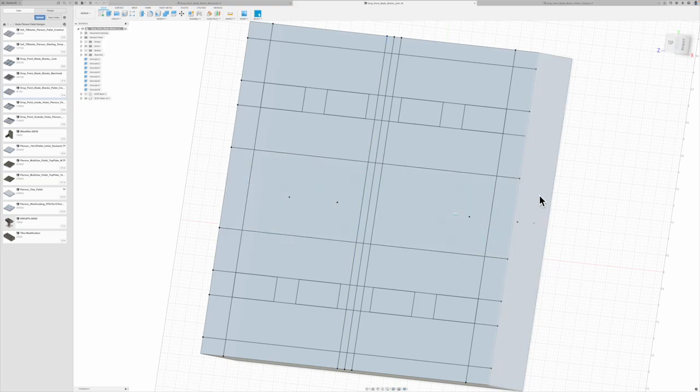First thing I learned is I need to stay away from this middle section right here and stay away from the lock rings that hold the pallet onto the Pierson Pro Pallet system. So my original plan was to leave that as a space in between, put my 4 blanks up on this side, 4 down on this side, and try to use the center section for my Mitee Bite clamps, kind of like how I used them on the end of the last pallet. Just really wasn't happy with that.